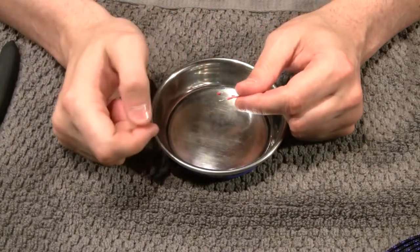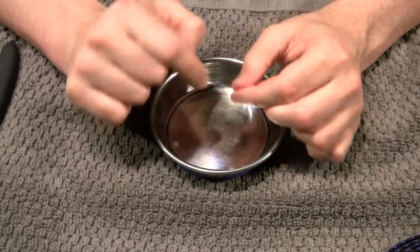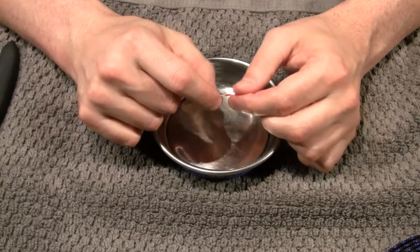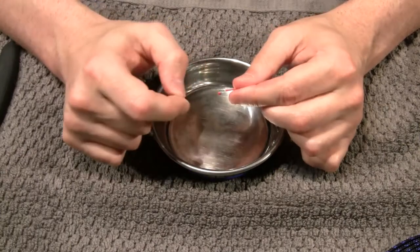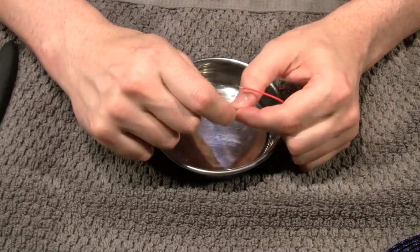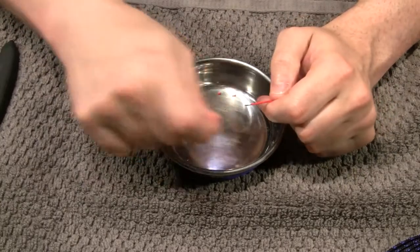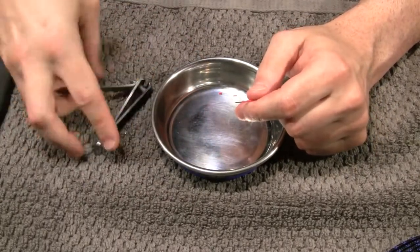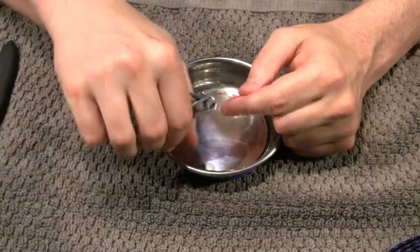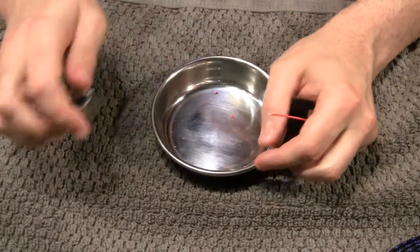If you're in a pinch and don't have the appropriate wire strippers, you can use scissors or something like that, but those tend to cut into your wires. If you notice a lot of frayed or cut wires after, you may want to try again. This is definitely too long for one of these tiny pins — they're smaller than my pinky nail. Just take your trusty toe clippers and cut. That's about the length I want — about two millimeters or so. Very short.